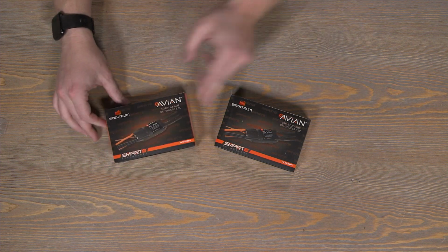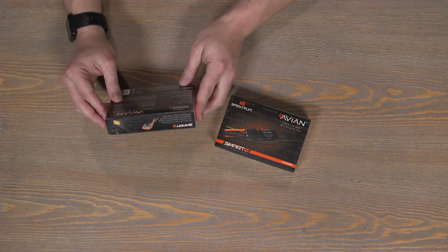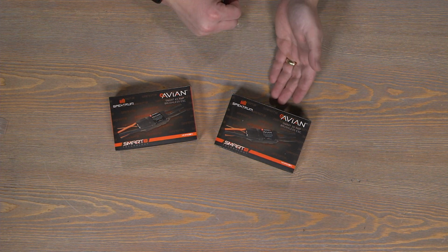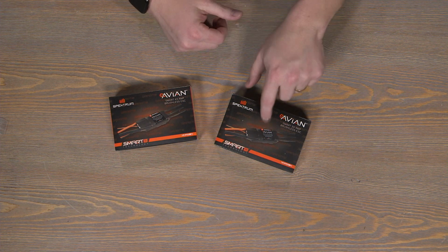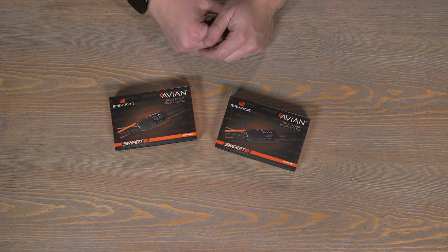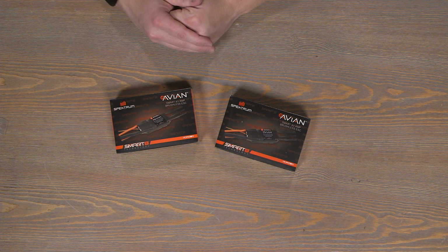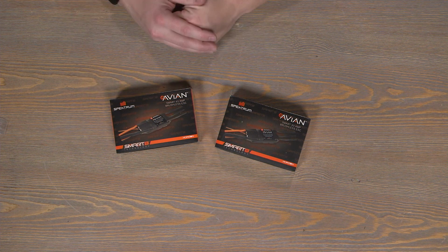The 45 amp is just a little bit beefier than this one. It can also handle 3 to 6S and it has a 60 amp peak burst current, but 45 amps continuous. This one would be a great upgrade for like your T28s, like the Park Zone T28 or the e-flite T28, different models like that. So if you have a model that already has a 30 amp ESC and you're looking to put Smart into it, that's probably a great option for that. The other one, the 45 amp, is obviously a little bit bigger, and if you were looking to put it into, let's say, like a Timber, that would probably be a good option for that, or maybe the larger T28.